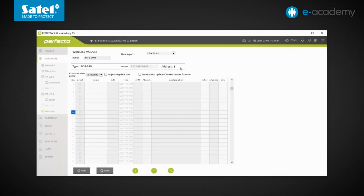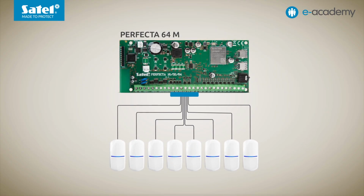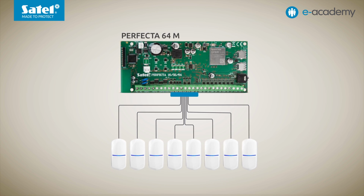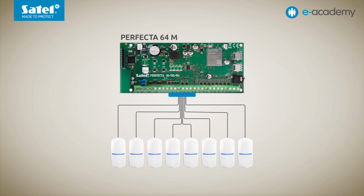And now attention please. When connected to the PERFECTA 64M control panel and identified, the ABAX 2 system controllers are given address 8 by default. Why is it important to remember this? I'm explaining this right now. It may happen that when building your system, you'll want to use more wired detectors than the number of zones available on the PERFECTA 64M control panel electronics board. And there are exactly 8 of these.